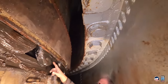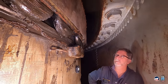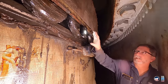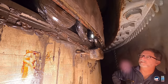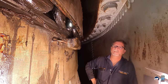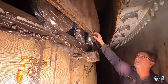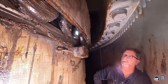To my right is the roller system. There's been some bad information out there on social media about what the material might be — these are in fact nickel steel. The entire roller system is precisely machined and hardened to be able to support the weight of the 2,000-ton turret turning around. This rubber here is to keep dirt off of the rollers and keep it out of the grease in the roller system.